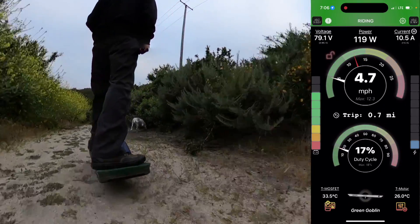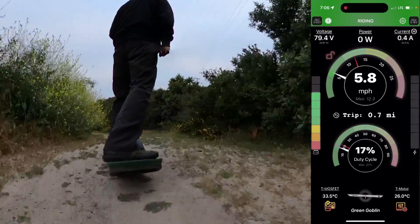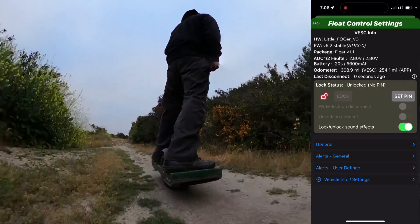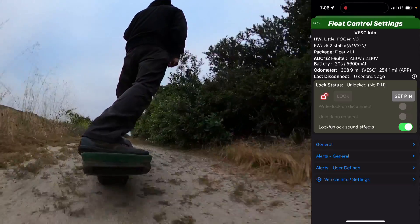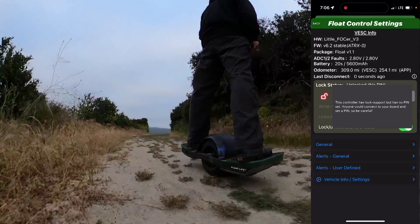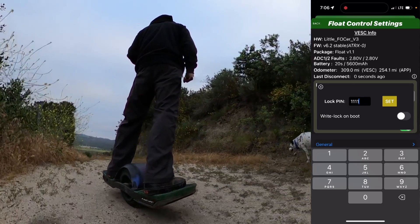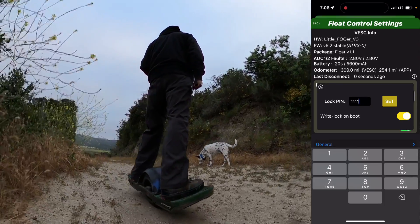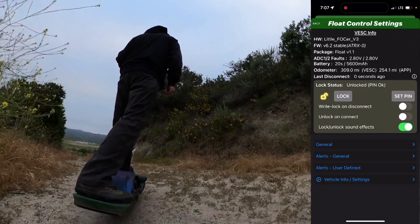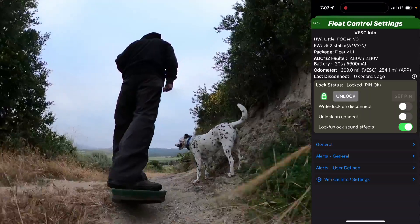Here is what it looks like. When I connect to the board, it determines the state, and it shows me a red unlock symbol. I go into settings and I can see the details — it says 'unlocked and no pin.' This is the normal state you'd expect if you had just installed the firmware. If you tap on the lock, it will tell you in more detail what's going on. So now what we've got to do is set the pin. I'm going to set 1111. I can also choose if I want to lock on boot — I'm going to do that, so if I power cycle the board it comes up locked. The pin is now set, but it is still unlocked. So now I can lock it, and the lock symbol turns green.